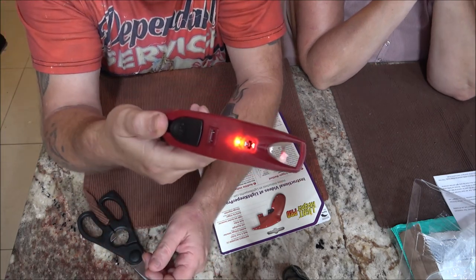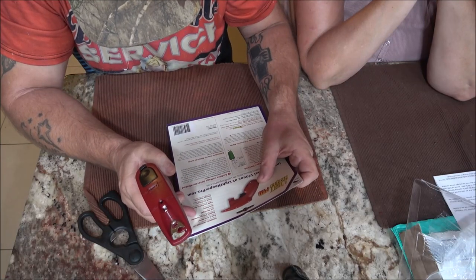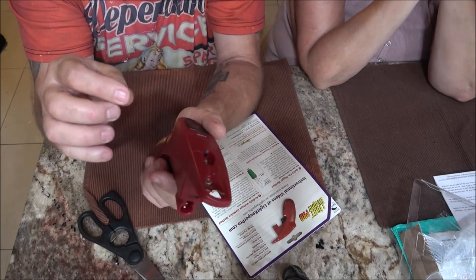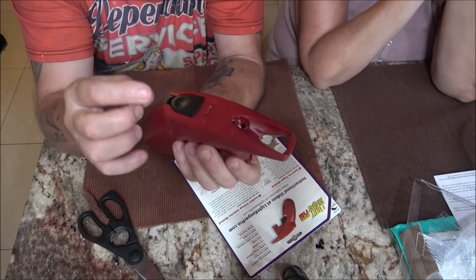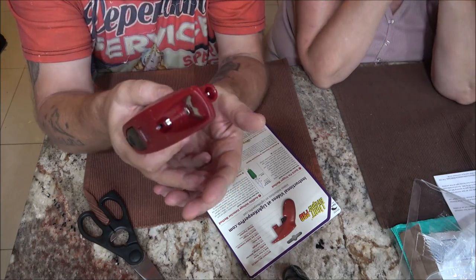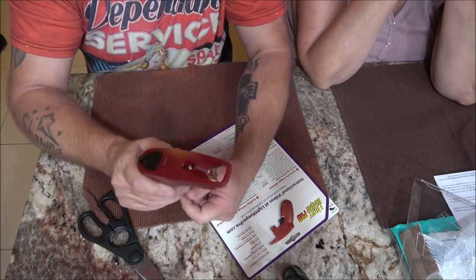All right, batteries are good. Bulb and fuse tester. Okay, so it shows everything here, but this trigger will help fix lights. When the lights go bad, there's something inside that bulb called a shunt. It's kind of like a little fuse, and each one of them bulbs has a shunt. When that burns, it not only makes the light go out, it makes a whole section of the lights go out. It's like pulling out a bulb. If the bulb burns out but the shunt is fine, then just that one bulb is going to be burned out.